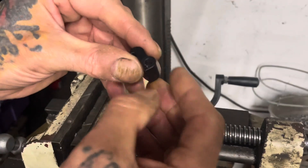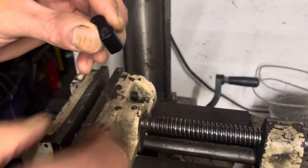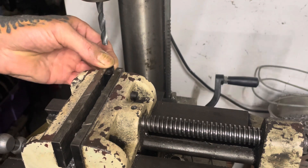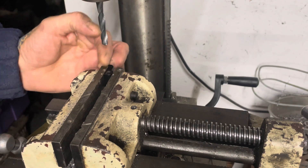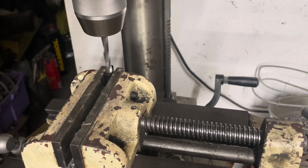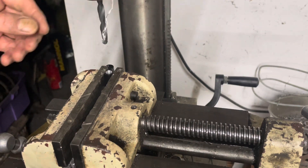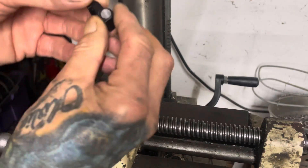So what you don't really want to do is think you can just put that in a vise and get a hand drill, or hold it in a pair of pliers and drill it with a hand drill. You actually want to get it in a pillar drill on a decent cross table. And then once you've set it, they all go in the same place and get drilled in the exact same place. Simple as that.